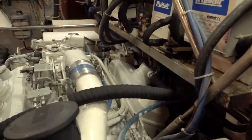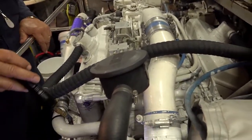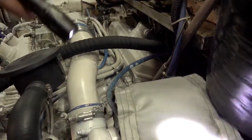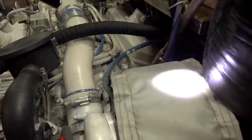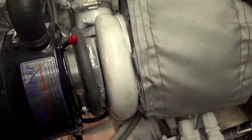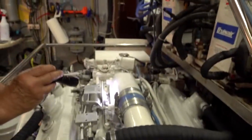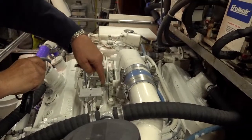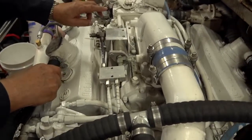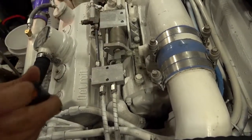When the engine is running, the exhaust comes out both manifolds, goes through this shell here, and turns the turbine, which is connected to the compressor turbine that takes incoming air and turns it into boost. The boost goes in through the blower and there's an aftercooler that takes water and cools that boosted air. The aftercooler is located below the blower.